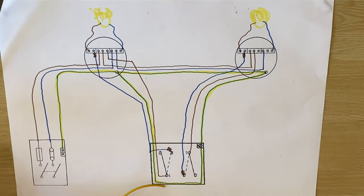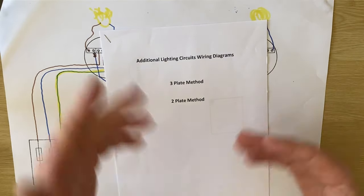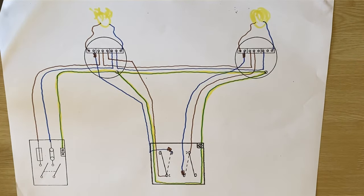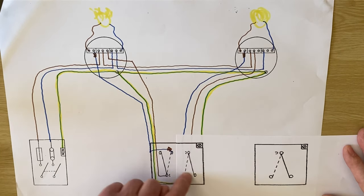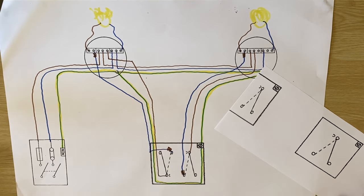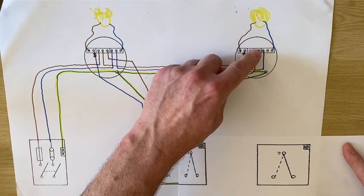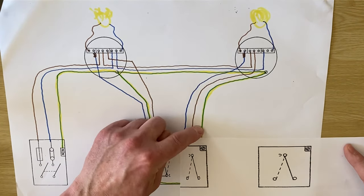The notes for these are available in a downloadable link — look in the description for access to this booklet. I will alter and change the diagrams as we go along. I'm going to add an additional sheet in a minute in order to show how we change the wiring here. We're going to need to move cables out of their current positions into new positions, reconnecting the two conductors coming down from the light switch — our line and switching line — and rediverting our CPC as well.